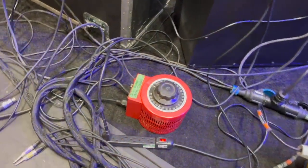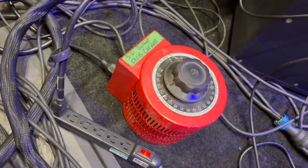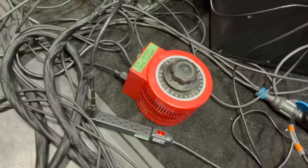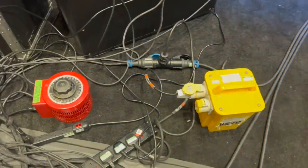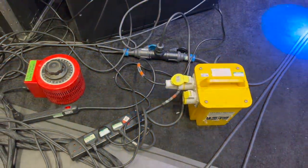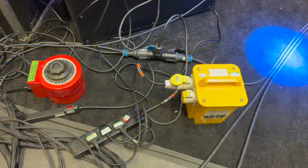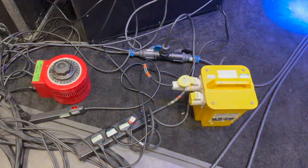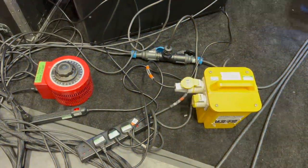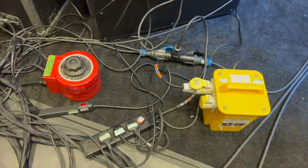And what I like to do is bring this 20 amp Variac with me. It's been with me since my days with Mr. Cornell. I got it back then to go to Europe. Basically, my reasoning was, coming out of the step down, sometimes the voltage can read as high as 125, 126, 127. And amps don't like that, anywhere from 5 to 10 volts over what they're supposed to be biased for.